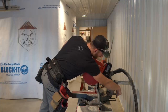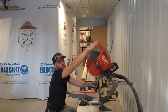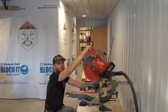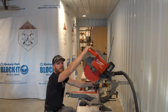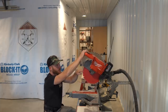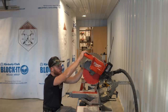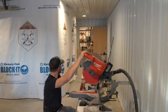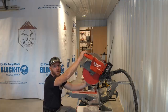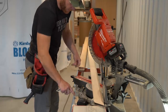Greg is putting some shutters in outside, and if you're wondering about the Tyvek back here with that RR logo, we're getting set up for chimney stone. We're going to have a nice place to cut. Even though we have the IQ Power Tool saw that is fairly dust-free, it still has a little puff of dust every time you cut stone, so we set up a tent to try and capture that dust and keep it from going throughout the building. It's pretty cold out, so we're going to try to cut indoors.